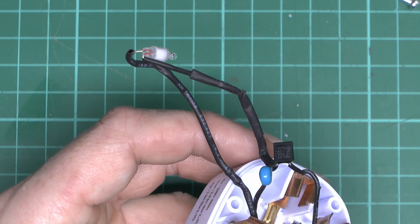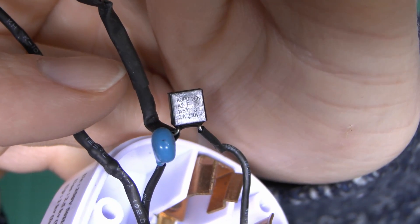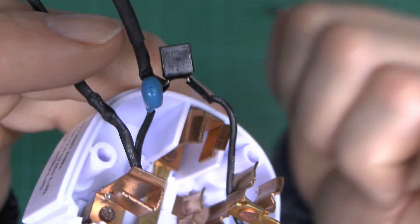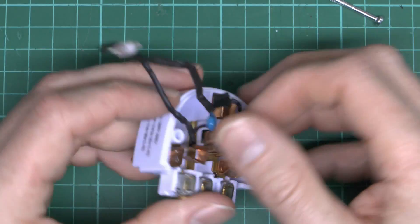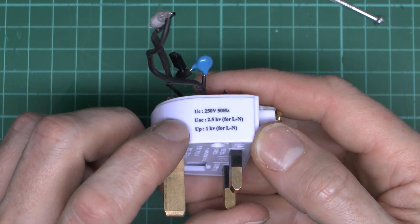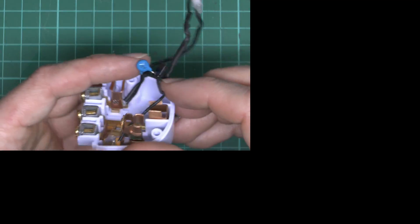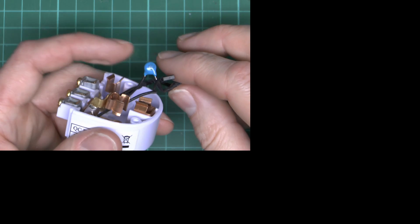Let's see if we can get any details on that. There we go — it's a thermal fuse, with a 2A rating and 115°C threshold. So it's heat-shrunk onto the MOV, and when the MOV gets hot and melts, this also gets hot and disconnects the circuit. Reasonably sensible design there. Whether it's going to provide much surge protection is another matter, but it does have a couple of alleged ratings on there. Again, it's line to neutral only — no connection to earth whatsoever. So it's going to do something, but certainly in terms of relying on it to save your equipment, it's probably not really the best choice.